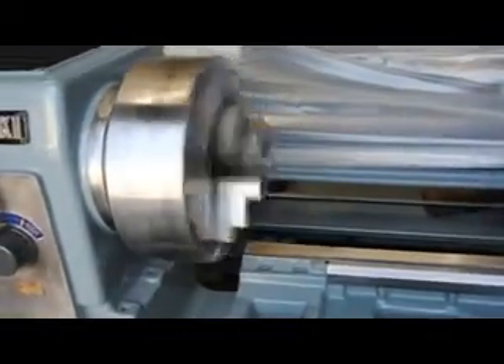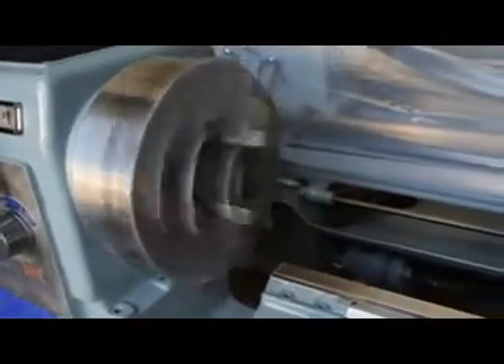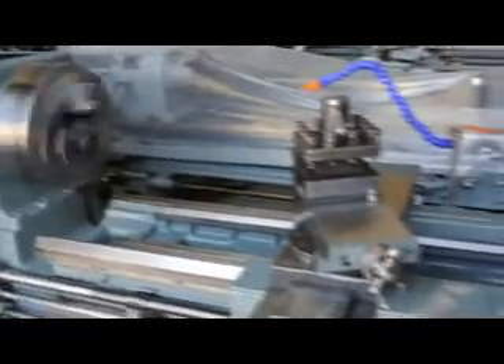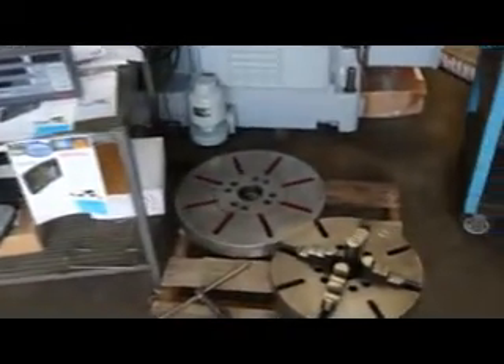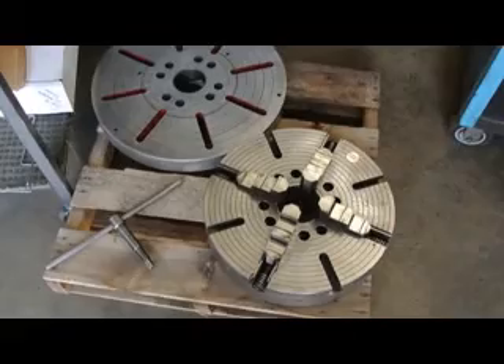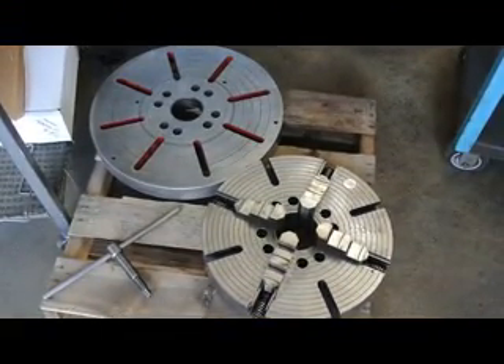We're running a steel body, 2-piece top reversing, 15-inch heavy pattern 3-jaw chuck, as well as the fact that the machine also has a steady rest. And we have a very nice 18-inch 4-jaw Emco chuck — a steel body with 1-piece top jaws. We also have a 22-inch T-slotted base plate.